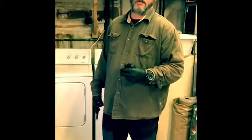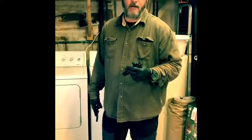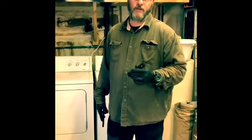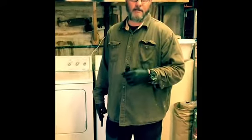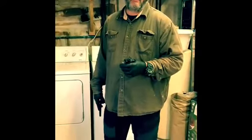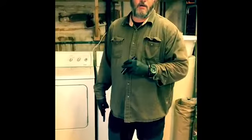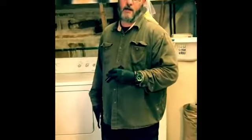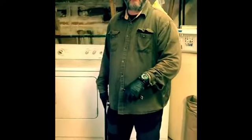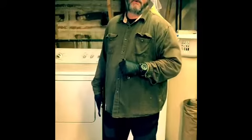So we want to make sure with the electrical we have things such as GFCI protection throughout the property, anywhere within 6 feet of water or an appliance. The rule of thumb is to have GFCI protection with your outlet. And then as for your oven range in the kitchen, we usually like to see that it has anti-tip brackets on the ground where you can't pull it to where it falls on you. Right, for like young children especially.